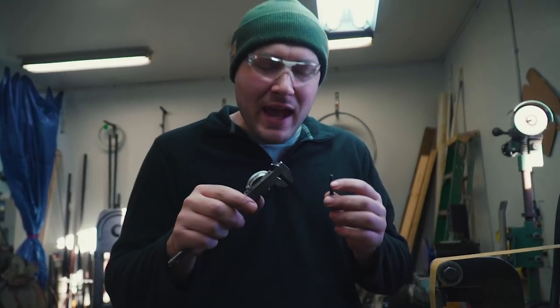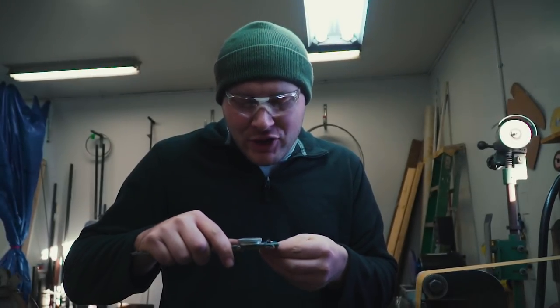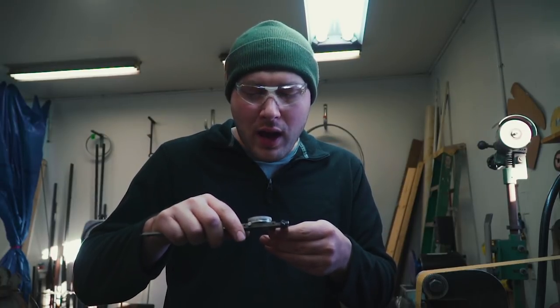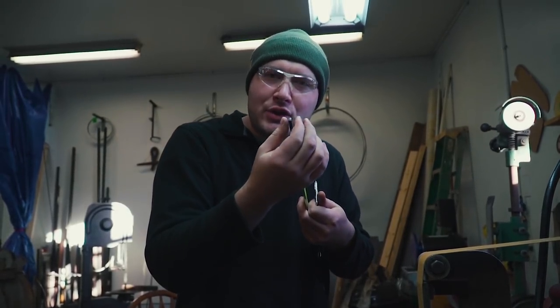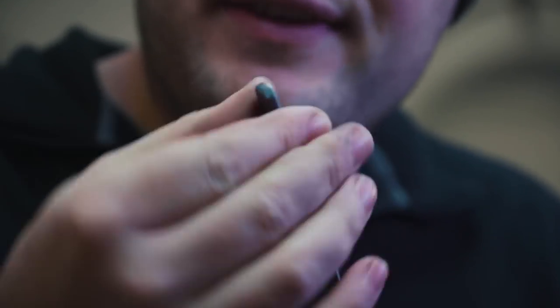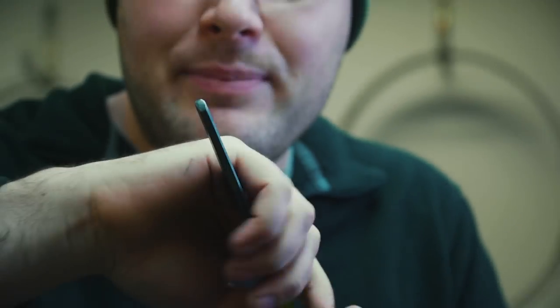So we're gonna thread the tang with 1/4-20 threads. So here's a 1/4-20 bolt right here. And measuring this with the calipers, it comes out to be just under 1/4 inch, just by a few thousandths of an inch. So that's how wide I'm gonna shape my tang to. And I'm gonna go ahead and round it. The tang is plenty wide for 1/4 inch, but it's only about 200 thousandths of an inch thick down here. So it's pretty much just gonna have threads on two sides, and then there won't be any threads here. It'll be kind of oval shaped.